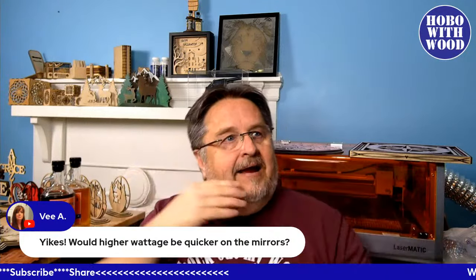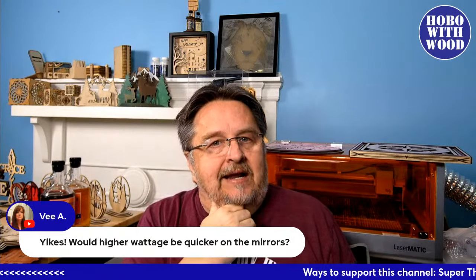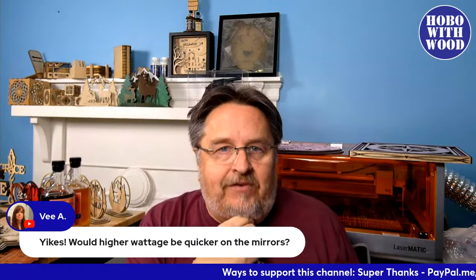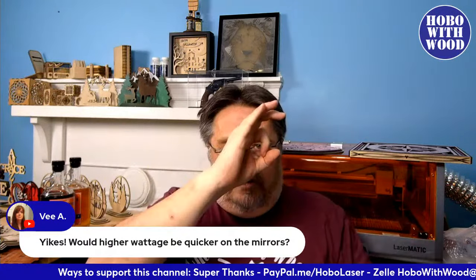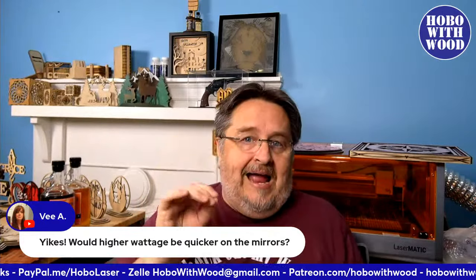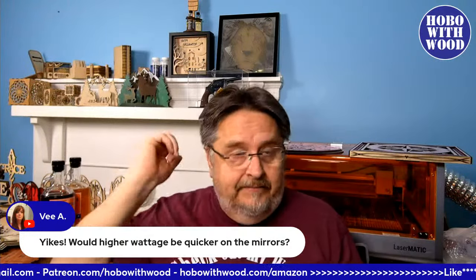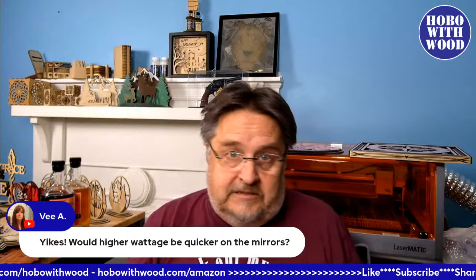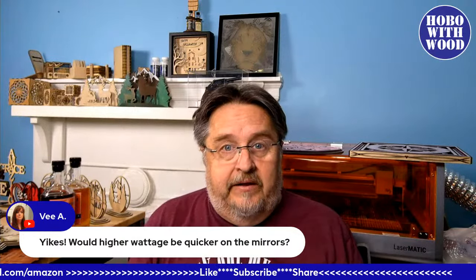And then instead of 318 lines per inch, I think I did like 500 lines per inch. So I had a larger dot size. It was overlapping itself two or three times. That's why it took forever. But I did such a high resolution and the settings that way I had them. That's why it took as long as it did. But the outcome is it's like it was done on a fiber laser.